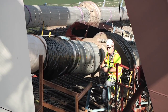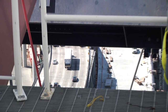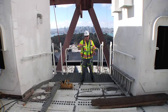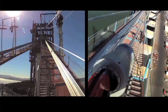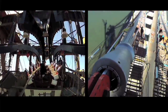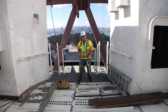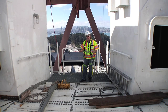Now there are some parts of the main cable that don't have this S-wire wrap, like the very top of the bridge. We're 525 feet in the air at the very top of the world's largest self-anchored suspension bridge. Underneath my feet is the main cable saddle. The single main cable comes up over the top of the bridge, goes down, loops around the back end, and crosses here again. This area is one where we really have to watch corrosion, with that cable going over it twice — and at this point, we don't have the wire wrap or the zinc-based paste. Everything's exposed.